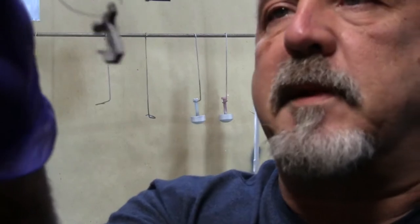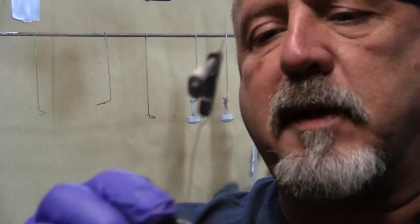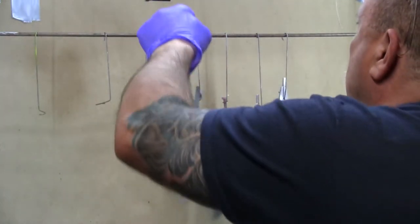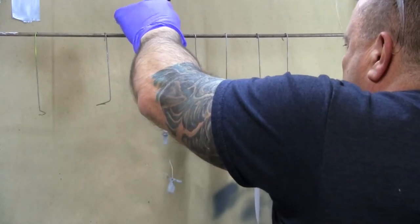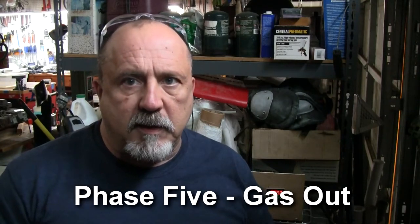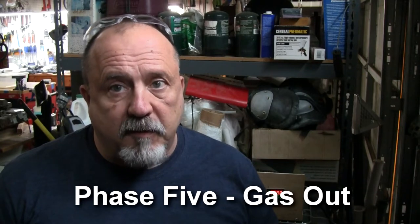Here's basically a string of parts. Some don't have a hole to thread through, so you wrap the wire around as best you can — it'll interfere a little but they're properly racked. We're not going to Cerakote just yet; there's one more step first. Phase 4 is complete — everything is racked. The next step is phase 5: gassing out. That's where you bake the metal components at 300 degrees for 60 minutes. For polymer, plastic, or wood you don't need to gas them out.